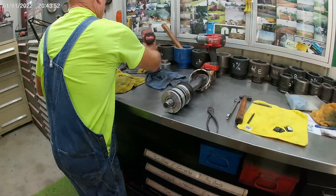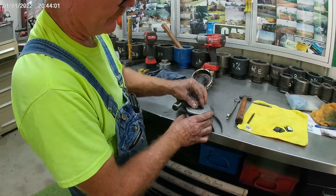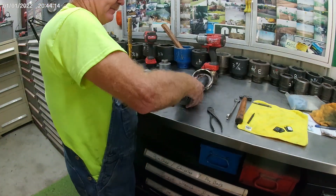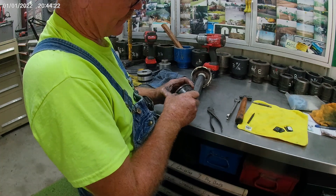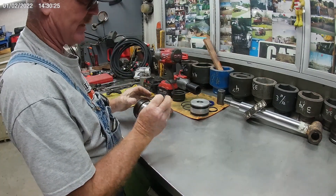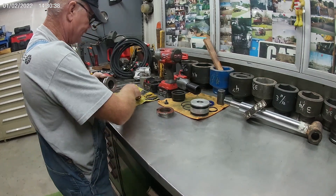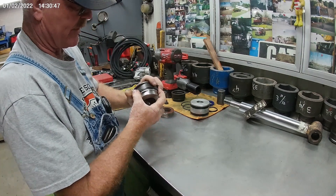Pull that piston off. There's an O-ring behind the piston — see where it fits in that little groove — so you've got two piston seals. O-ring in the groove, then pull the head gland off. There's a backup ring and an O-ring here, and a U-cup and a wiper. We're going to start on the outside by putting in the backup ring first. A lot of backup rings have a little bevel in them — backup ring always goes on first, and that bevel goes up so that when the O-ring goes on, it sits in that bevel. Pull them and rotate to make sure they stay straight.